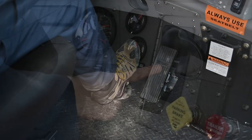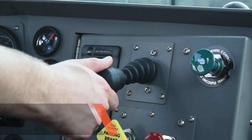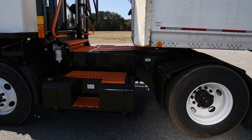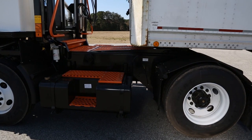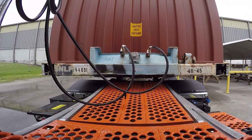With your foot firmly on the brake pedal, the transmission in neutral, and using the boom control lever, raise the fifth wheel up until the trailer landing gear is just off the ground. With your foot still on the brake, shift into reverse, release the foot brake and back firmly into the fifth wheel jaws until you feel full engagement. Now shift into a forward gear and give a little tug to make sure that the jaws have locked on the kingpin. Be ready to immediately apply the foot brake if a full lock of the kingpin has not been accomplished. With the fifth wheel and kingpin securely locked together, shift into neutral and raise the trailer to the necessary height to maintain landing gear ground clearance.